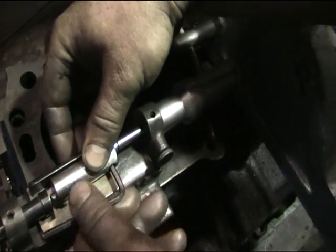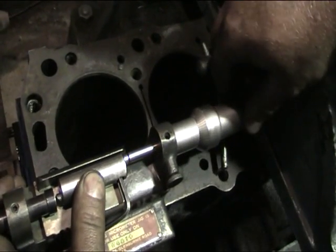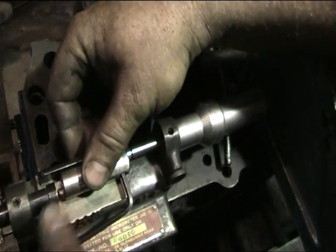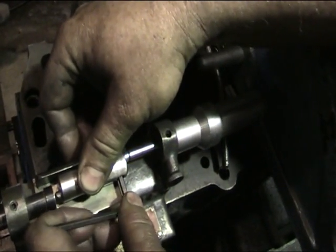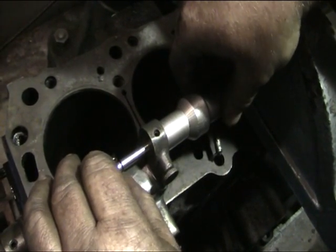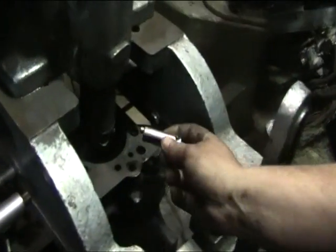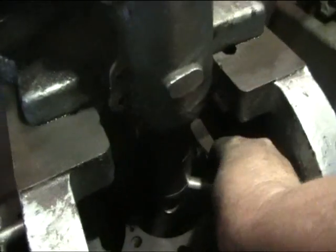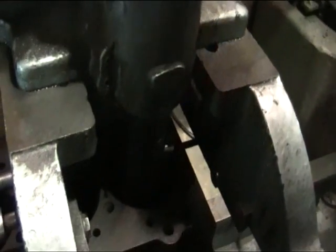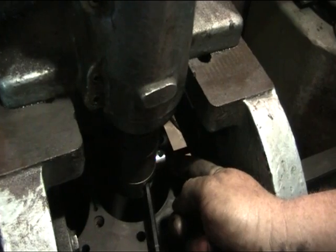This is done by loosening the toggle. There's a spring inside — it's a direct adjustment piece. Bring it around to ten and five, then lock the tool. Back it off slightly and check it. Then we place the tip into the boring bar itself, into the boring machine. Shove it in, make sure it's snug. Rotate it slightly so we can get the tooling in, then use a simple Allen key to lock it in place.